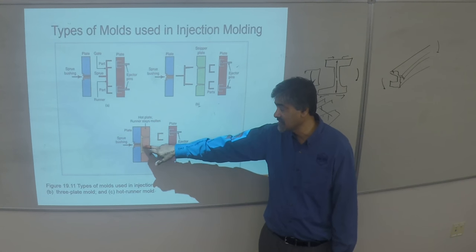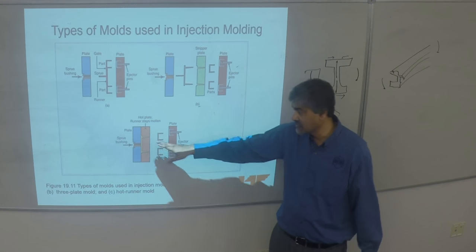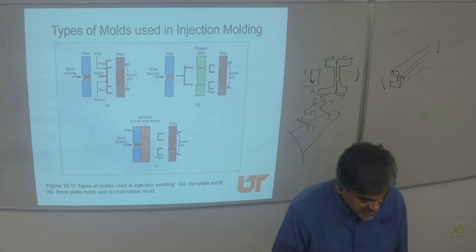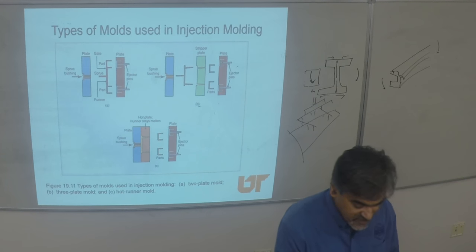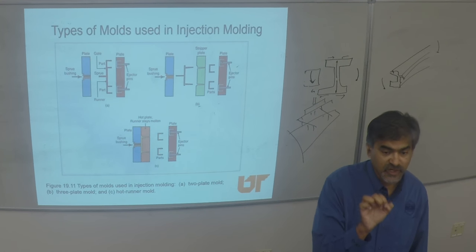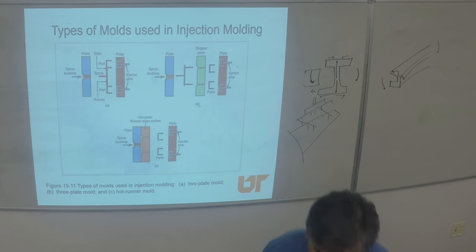In those cases it doesn't make sense to stop the sprue, keep it hard, and then feed the next. You can recognize hot runner parts by looking at the impression where it got ejected — you'll see a very small dot-like thing, like on cell phones.